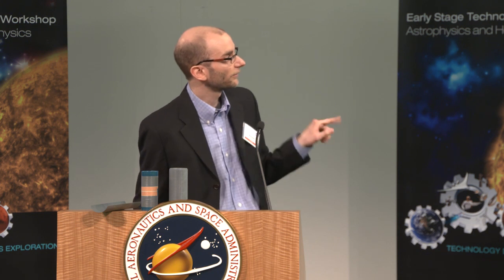Around the perimeter, you see the ring truss, which is 20 meters in diameter. And this truss at a half scale has been designed by JPL, and they did a full assembly this summer. There's some cool stuff online, some YouTube videos you can see of that system deploying. Around the edge are 28 petals. They're each 7 meters in length. They have a spire or a tip on the ends, which come to a fairly tight point. Around the perimeter of the petals is kind of like a razor edge, sharp edge, in order for the light to diffract around it.